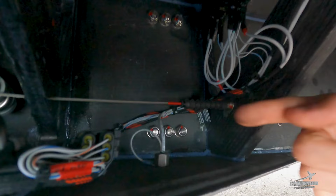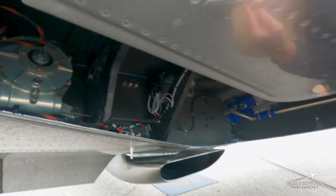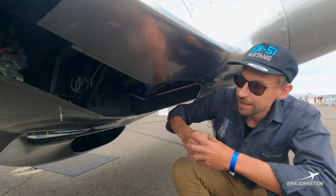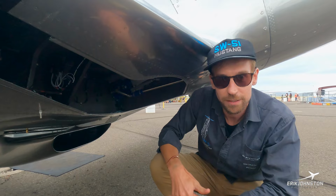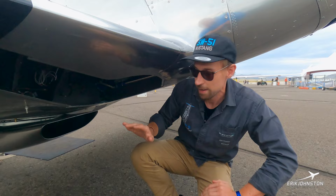For each landing gear we have one drive unit, and we have one lever with a Bowden cable, where there is a pin, and that pin is keeping those springs under compression. But if you release the handle, you pull back the pin, and then the energy of the springs pops out the landing gear within only about 1 second, and it also locks the landing gear. So that is our emergency backup system, which we, by the way, have also already flight tested, and it worked well.